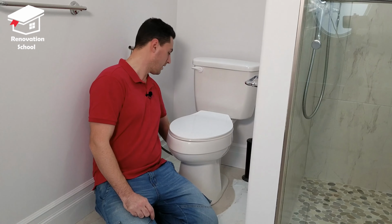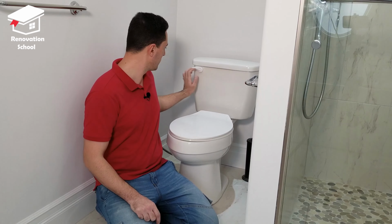My name is Mustafa, and in this episode I want to show you how to replace a toilet. The first thing you want to do is to turn off the water line. After you turn off the water line, you want to flush the toilet and hold the flush for about 10 to 15 seconds.